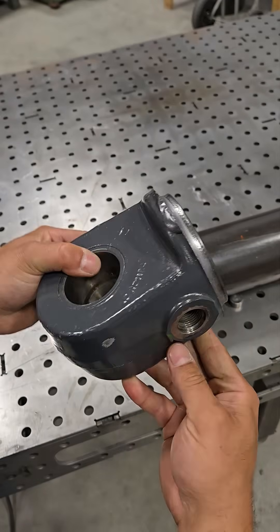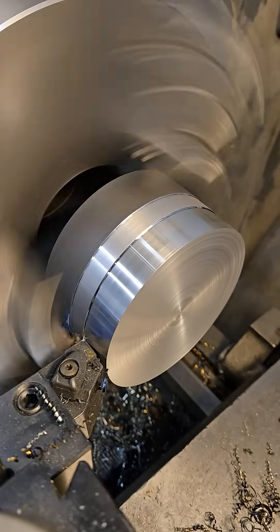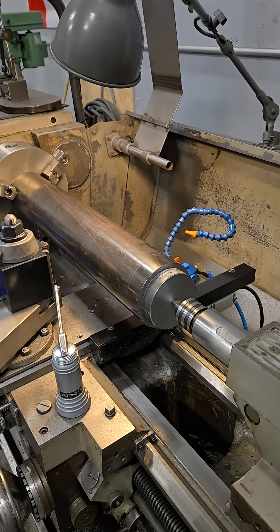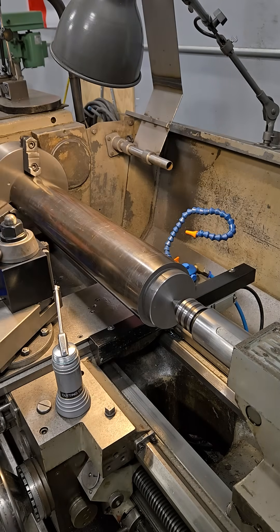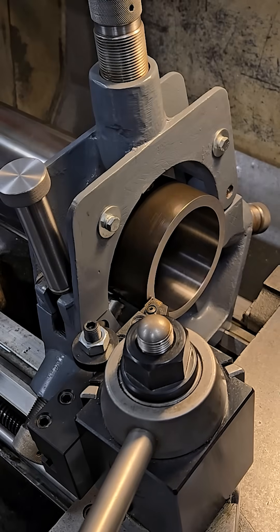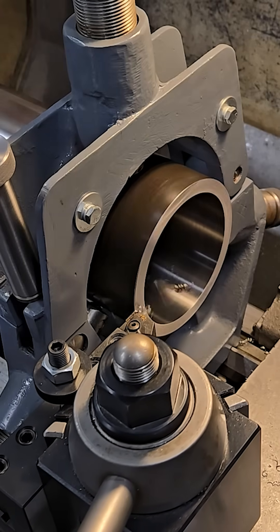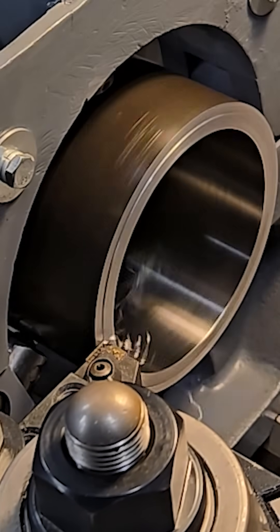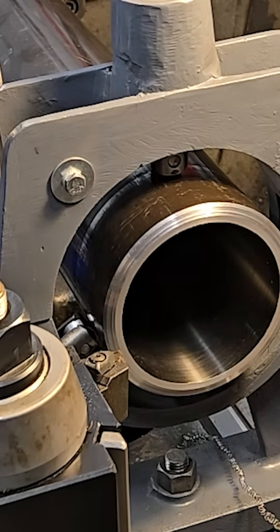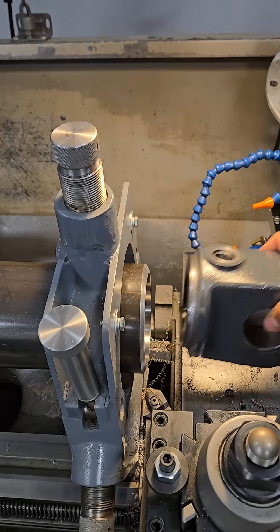The mount end of the cylinder is now in my hands, ready to adapt to its new home. First we're gonna have to make a little plug — this is gonna go in the back of the cylinder and it's gonna hold it perfectly parallel in the lathe, because this tube is really heavy. This is just a little hack on getting the steady rest set up quick. So the first task with this thing all set up in the lathe is facing the first end. Now I'm putting a chamfer into the end — a big bevel — and this is gonna be the weld prep, and that's gonna let us get a really high penetration weld in there. It's gonna be very strong.